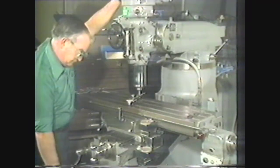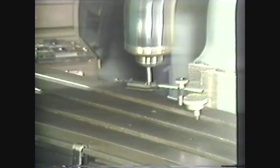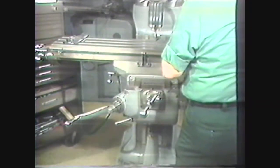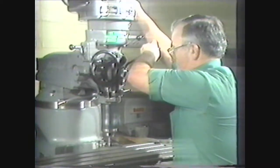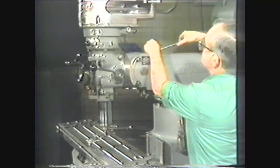For precision machining on the vertical milling machine, check the milling head for alignment. Secure a dial indicator in the machine spindle; this instrument should sweep a circle just slightly less than the width of the table. Bring the indicator point into contact and deflect the needle, lock the quill, and tighten the knee clamping bolts to take up any front sag in the knee. Set the indicator to zero, check the setting on the back of the table, then on the front. If the readings are different, loosen the clamping bolts one at a time and retighten them to give a slight drag — this drag allows fine adjustments without the head shifting.